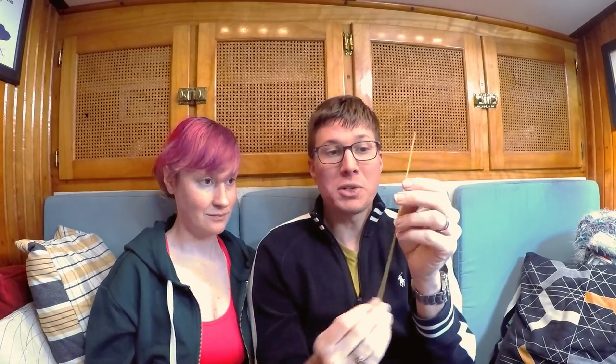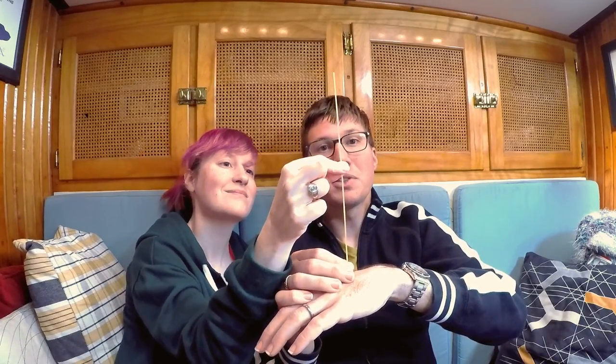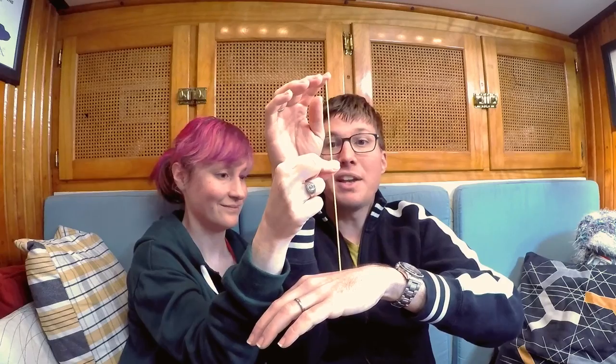Now one more interesting thing — say you have your mast and it's very flimsy. You have a deck-step mast, so here's your deck and the mast is simply standing on top of your deck. Those tend to have usually around two spreaders. You have the flimsy mast, and if you act as a spreader in the middle it becomes a lot less flimsy. When I put force on it, it's not so jiggly. And then if you have a second spreader, it becomes even less jiggly. That is the idea behind two-spreader rigs on deck-step boats.